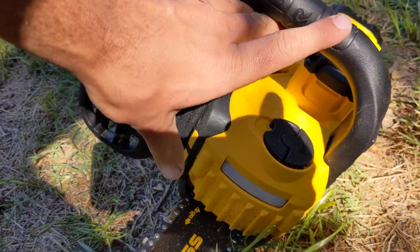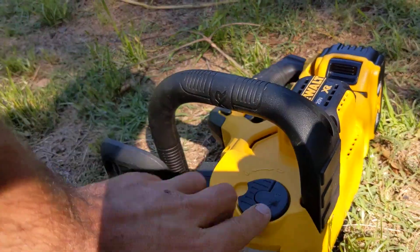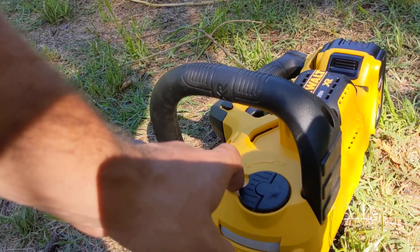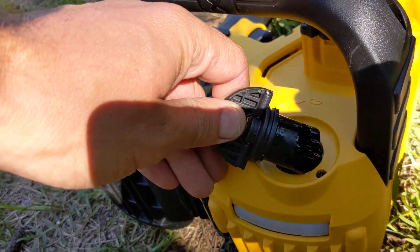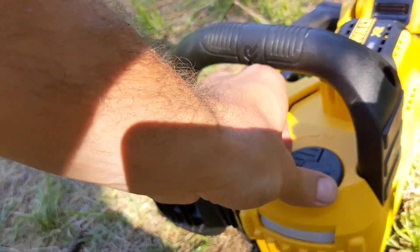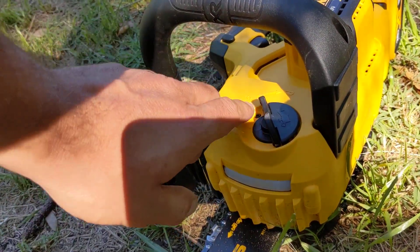A lot of people had noted online in Amazon reviews about this cap being very difficult to go back in, and it is. The first time I took it out I tried to put it back in and it was very, very hard. This is the bar and chain oil fill cap. I found that once I put bar and chain oil in it, the cap actually didn't have much of a problem. I think the design was made with the intent that when you first take it out, you're going to put oil in it so it will lubricate it. If you don't do that step it will make it very difficult — the cap goes in with such ease now, but when I first did it I almost broke it because I couldn't get it to the locking position.